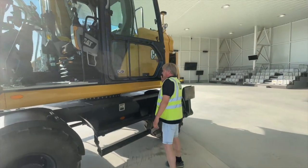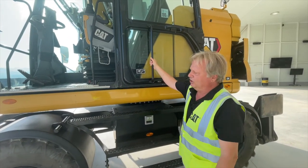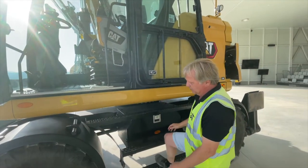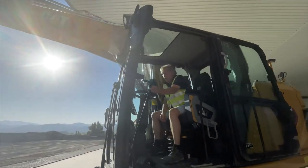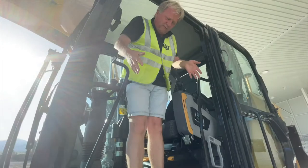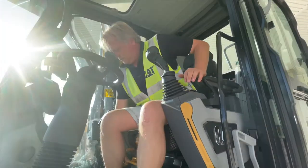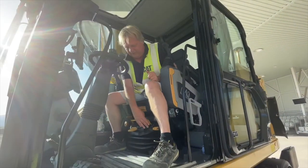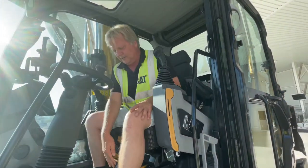The cab is important for safety. We had this system also on previous machines — to enter the cab safely, everybody knows three points of contact. When you go with a wheel excavator, a lot of people climb over the tires. Here it's easy — we have steps, including a lower one, so you can get in here easily with safe access. The steering column can really move forward, I can move my seat, giving me perfect access to get in and out of the machine. I can adjust the armrests, adjust the joysticks, adjust the height of the joysticks. Everything that's yellow, I can adjust — it's like suspension, forward reverse, seat, armrests — everything yellow.